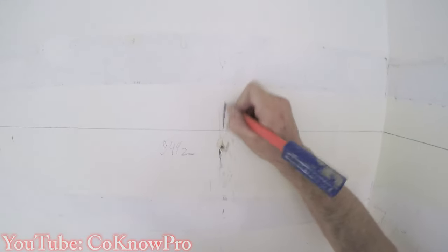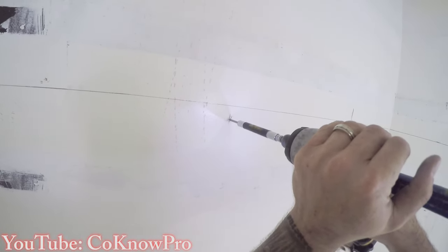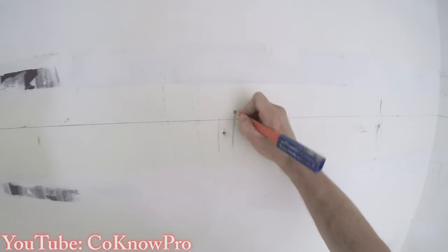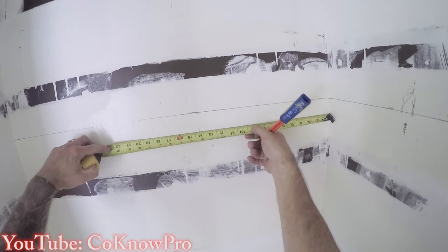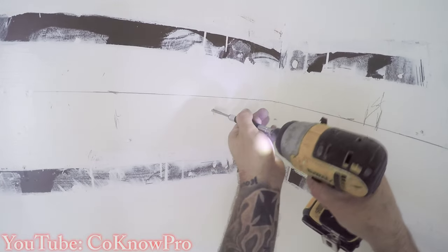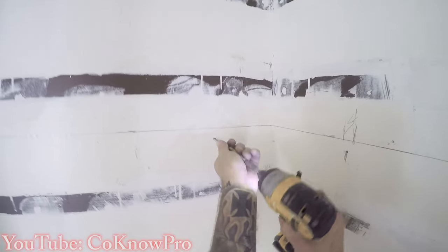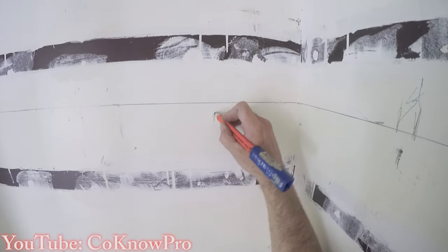In the meantime we'll be nailing everything to the two-by-fours to make it secure and solid. We found meat — looks good. What I'm using is a three-inch screw to find my stud. This is old lath and plaster, so if you use a stud finder on old lath and plaster it's not going to work. It's always better to find the stud layout and screw into it to find wood. Once you have that, your stud layout is going to land 16 on center. Verify where they're all at, mark them, and you can scribe your layout onto your new ledger.